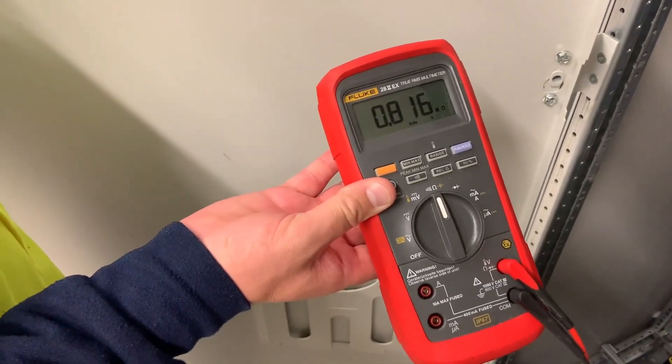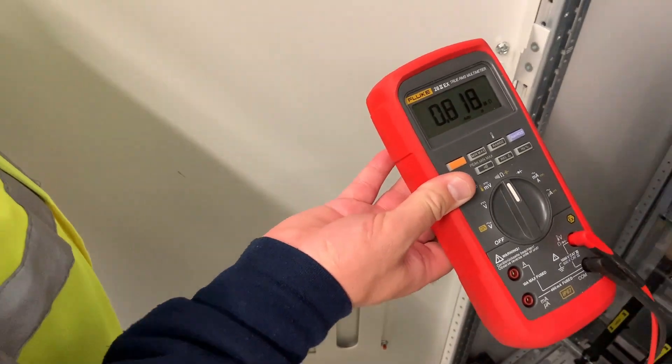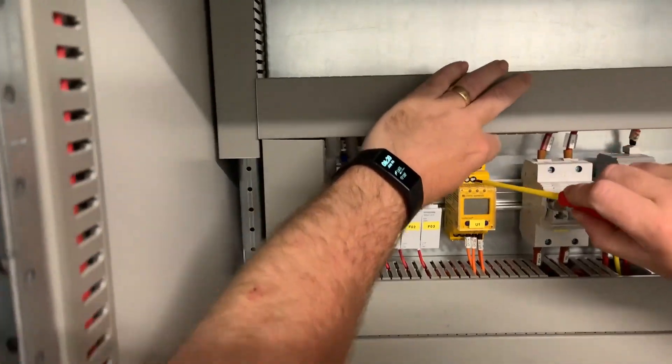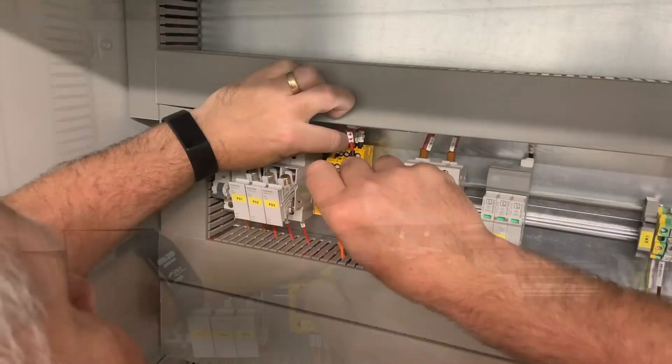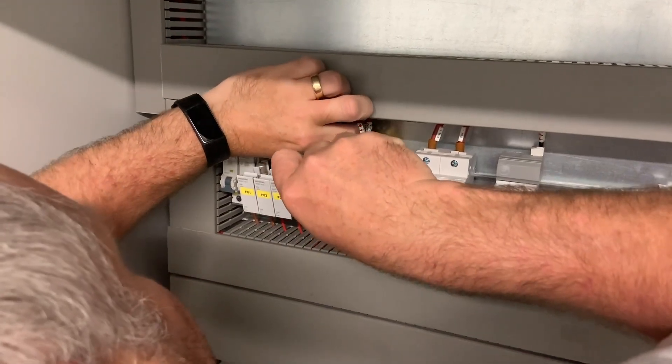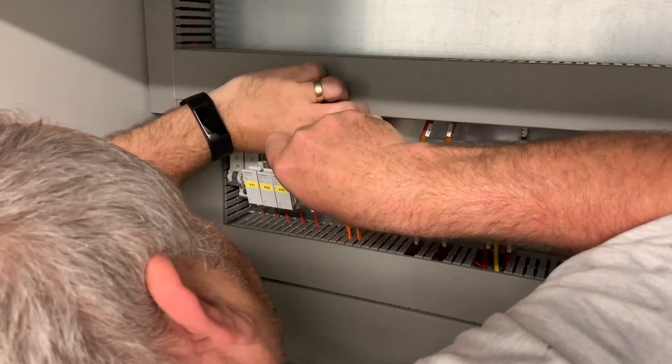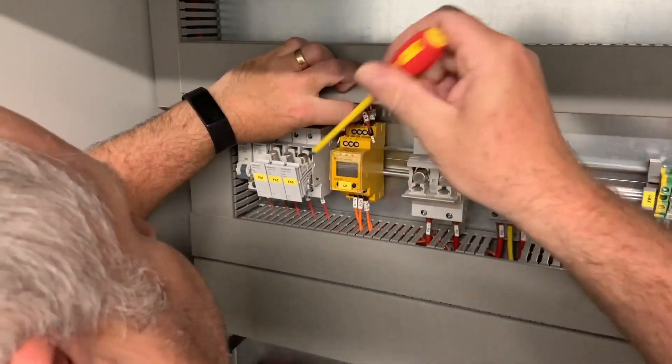We have about 800k, which is far too low. Checking the drawings again, we find that we have to disconnect this module which detects the resistance between the positive and negative rails, as the electronics inside the module is causing this 800k value.